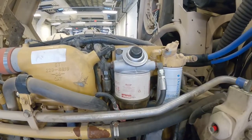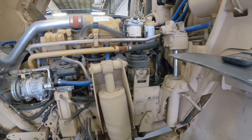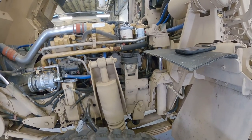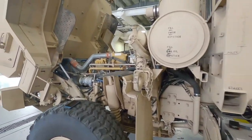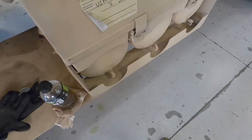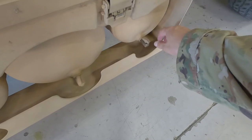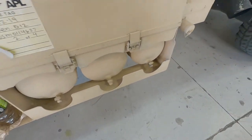The TM says this priming should be done in the after portion of your PMCS, but honestly I only do it about once a week. Now the truck has been fully serviced — let's get everything buckled up and back together. Make sure nothing is leaking, then run the truck for about 5 minutes. Remember to drain the air tanks and close them back up so you don't get moisture in the system. Call it a day.